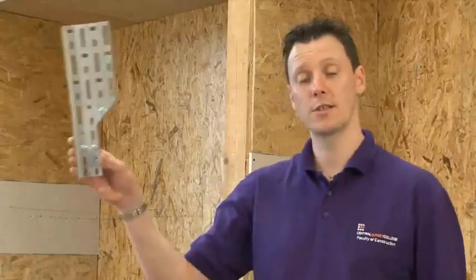Our next task is to fabricate a cable tray reducer or enlarger, depending on which way you're looking at it. There are going to be times when you're going to have many cables and you're going to reduce those down to just one or two, so you can reduce the size of the tray to make it cheaper and easier for you to work with.